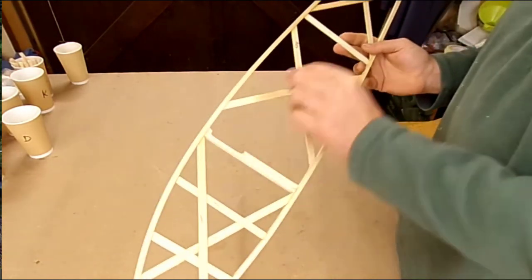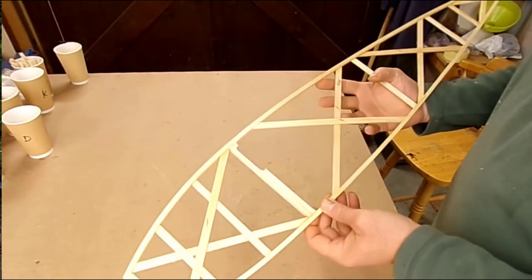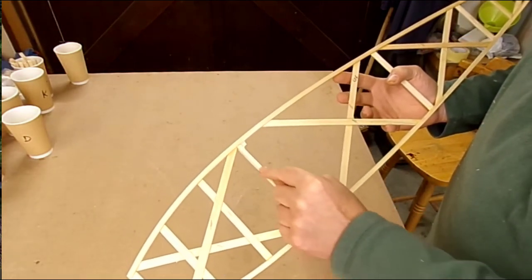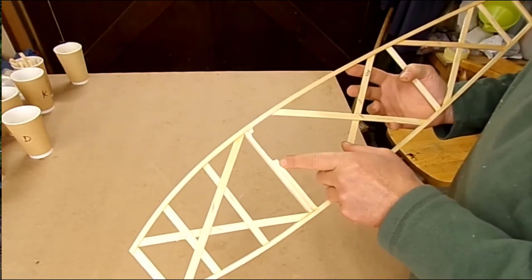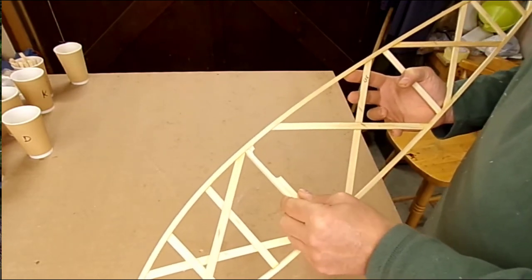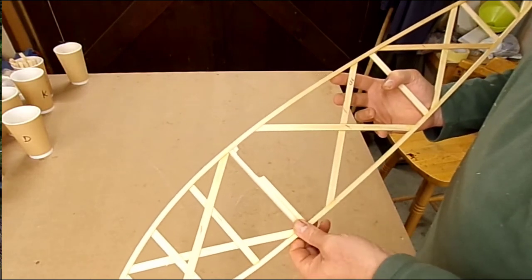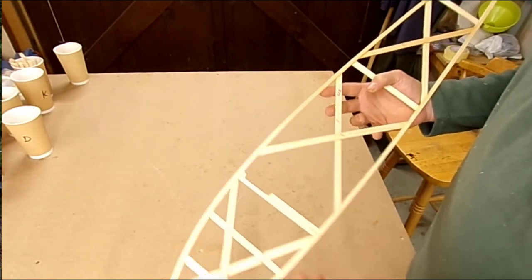This one is the 6th one out on the lower wing, and I put a piece of rib cap piece along the front edge here, because you take out 5/16, is what I've taken out from this vertical piece here, so it'd be rather fragile and chances of breaking. I mean, the chain leaves about 1/16 of an inch there, so I'll put this cap piece in to give it just a little bit of reinforcement there, so it can't crush or anything else during the actual assembly.